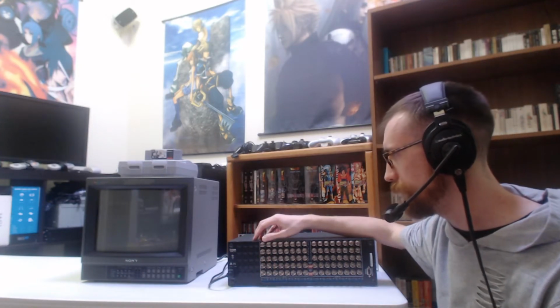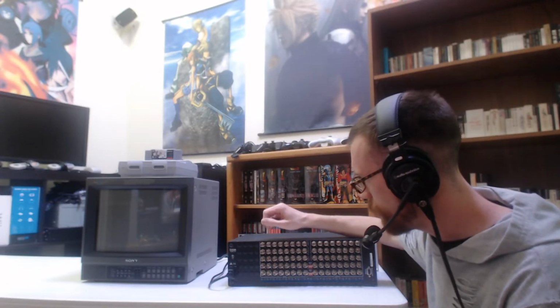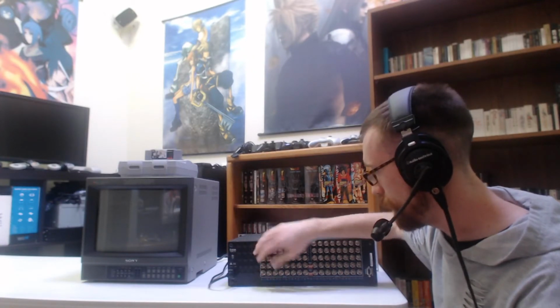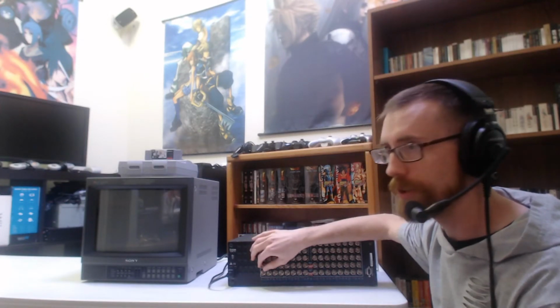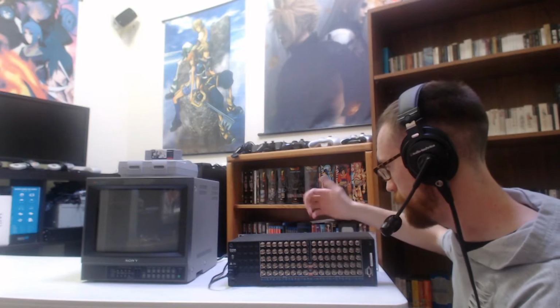I didn't want to go down that route because since they were kind of expensive and rare, I just went with using the little Extron S-Video distribution matrix, because then I didn't have to convert BNC to S-Video. It just already had S-Video as its default connection. So then if you want to do Component, then you would just do YPBPR and run it that way. So you'd use the top 3. And then depending on what type of PVM you have, if you use one that has RGB HV, you would have to use all 5 of these plugs. But if you're just using RGBS, the H plug also works as H/HV as well, or RGBS. So it can be H, HV, or S. So you can run 4 cables into that. And then on the other side of it, you would just output 4 or 5, depending on your PVM and setup.